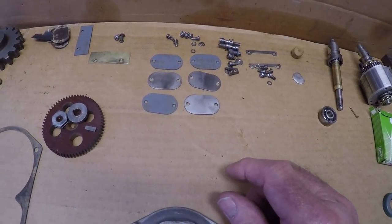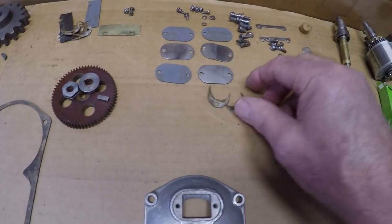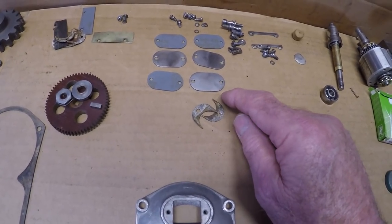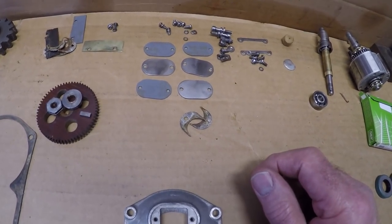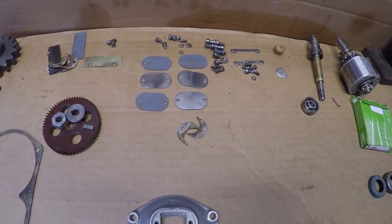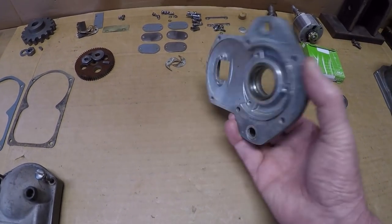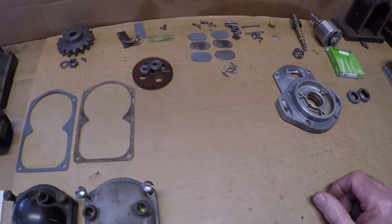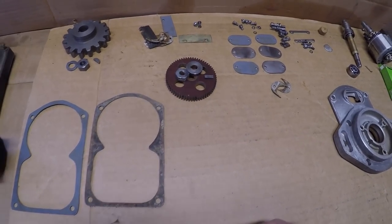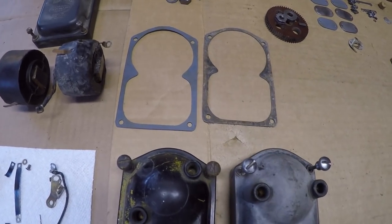Got new gaskets made for all the vent seals and stuff. You'll see these are solid — they're not vented. You can see the originals had a big hole in them. That's not necessary because that's for advanced systems where the advance goes for the mag plate or the point plate through one of them, so you've got to have a hole in the gasket. Solid gaskets for this mag are okay because it's not a vented mag. Here's the cover all cleaned up, ready for the seal installation. Got the drive gear for the cam caps and made myself a new gasket for that.